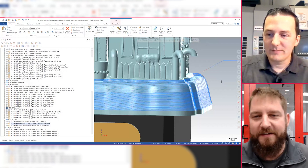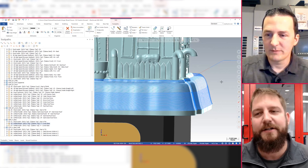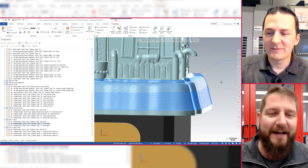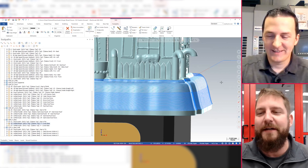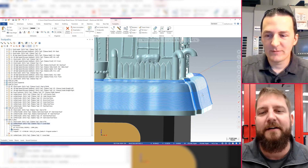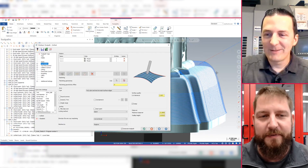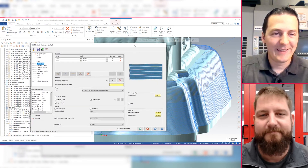And that was the easy part too — once we realized what was going on and what we saw there, being able to go into our parameter pages, make a change, hit the apply button — I get to see the changes on the screen right away. After all these years of running Mastercam, that's probably my greatest improvement you guys have made: I can update it inside of there, get my quick view because I'm able to zoom in on my problem corner, make my changes, see how it affects it. I can go make another change, hit the apply button and see it generate live. Nothing better than being able to work on your toolpath while seeing your part at the same time.